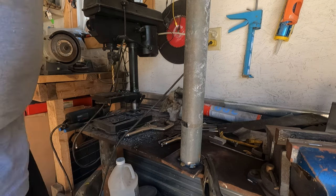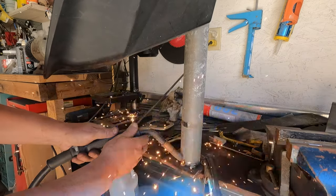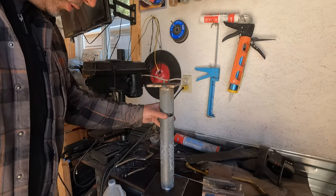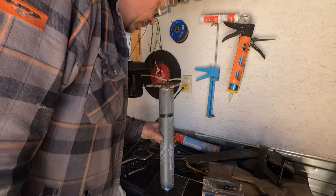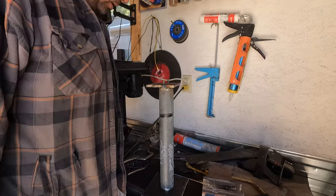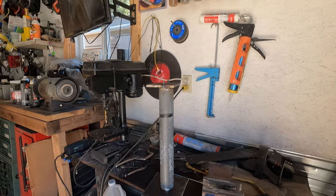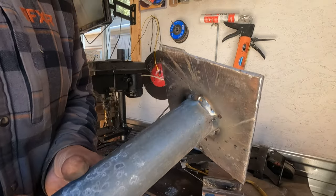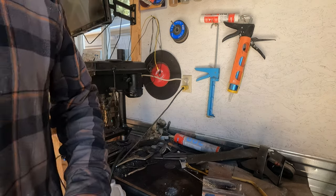Alright, it's nice in there now — we can weld her in. Alright, so bottom plate — just got to weld that on there. I cleaned it up with the grinder and got some of the rust and old paint off that metal. I just center these and get them pretty much lined up square with the top plate. A little tack in place — just a few tacks, not a complete weld but almost. So there we go — one extension. We'll see how she fits.